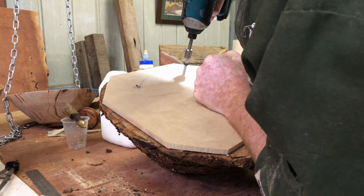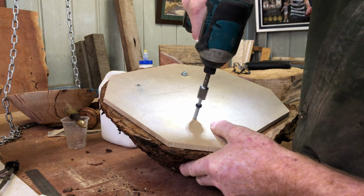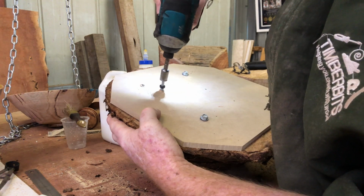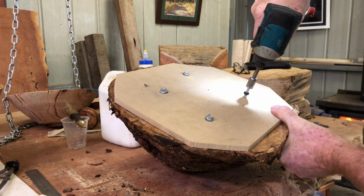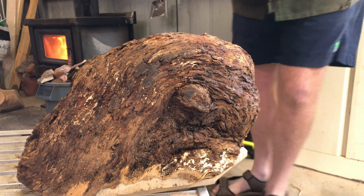The yellow box is beautiful, but it's a hardwood, and the burl didn't disappoint. I used quite a few tools this time on the burl. The main tools I used were the roughing and spindle gouges. I used a carbide tool and a negative rake scraper.